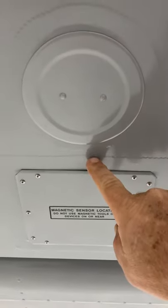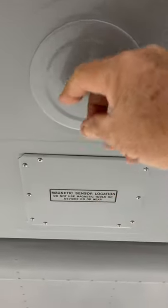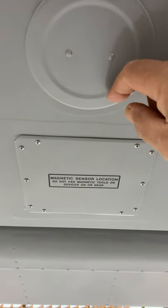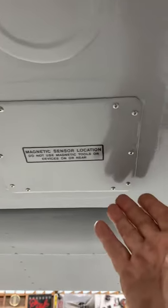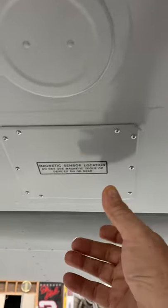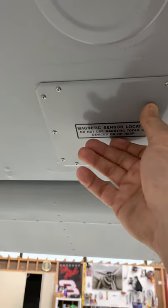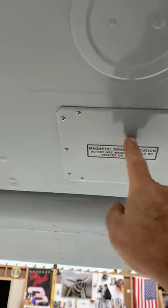Basically the spar is right here. We've got an inspection hole on this side so we're going to be able to get up in there and get the nuts on to the bracket when we mount the magnetometer on the aft side of this bar. Right when you mount your wings, you'll mount the magnetometer into the mounting bracket, put it up in here, and mount it. It's got two screws that go through there, which are double nutted.